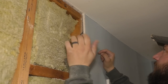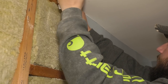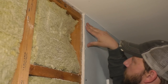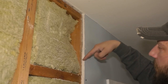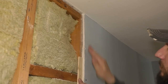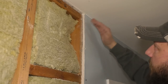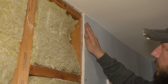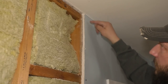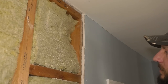There's a seam right here and I can see this is starting to move. Now we have a crack. Well, new plan. Because there is a seam right here, what I'm going to do is stop my furring strip about here, and then this will dive back to half inch. When I mud it, I'll just make sure to put a little more mud up here. I can tell that as I do this, this is starting to move this way but this is not moving — so it's just not going to work the way I wanted. I'm going to reattach this tight, the drywall will meet up and be even, and I'll just add an extra layer of mud.